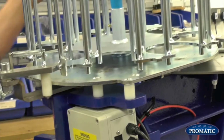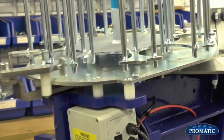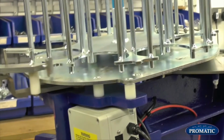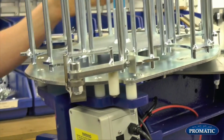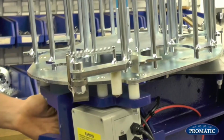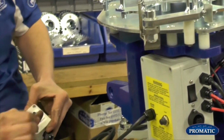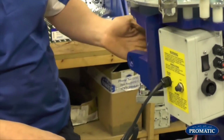So even if you do move the carousel away from the rear pusher, he will just catch it up, and then he goes back to self-timing himself that way. So don't worry too much about where the carousel is in relationship to your rear pusher, as long as you're at 6 o'clock. Just nudge him straight back into the 6 o'clock position.